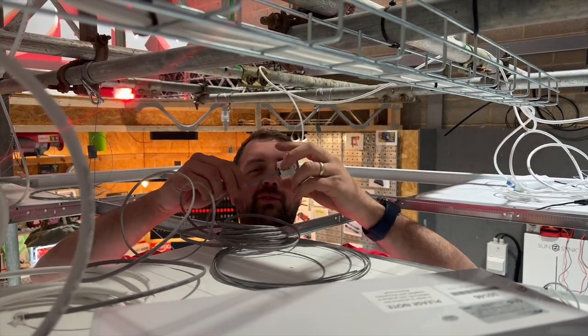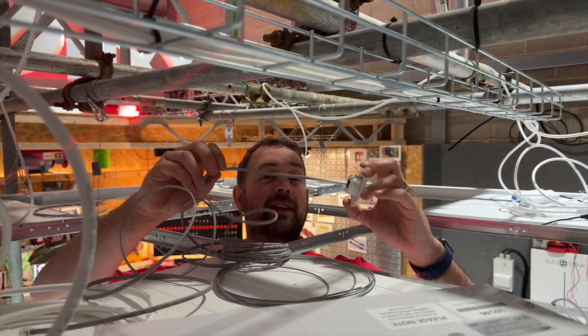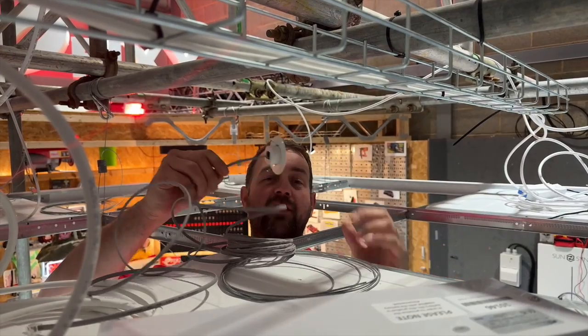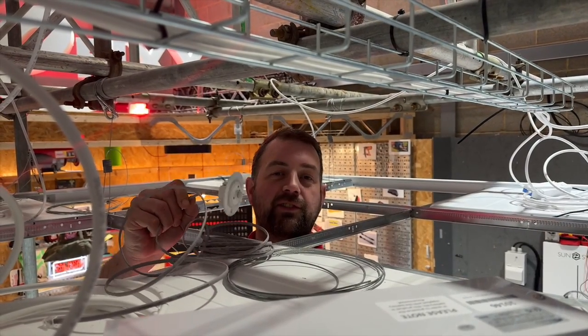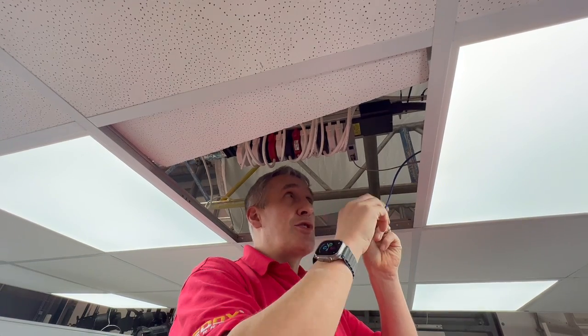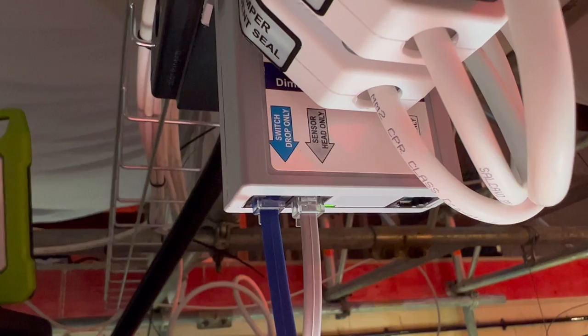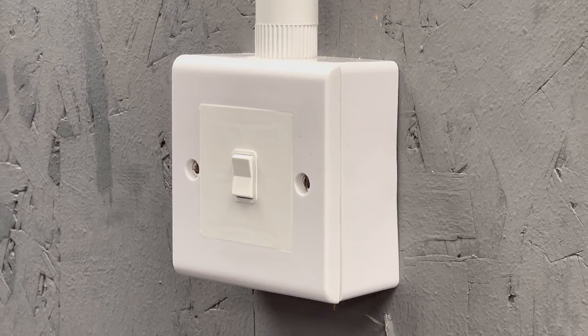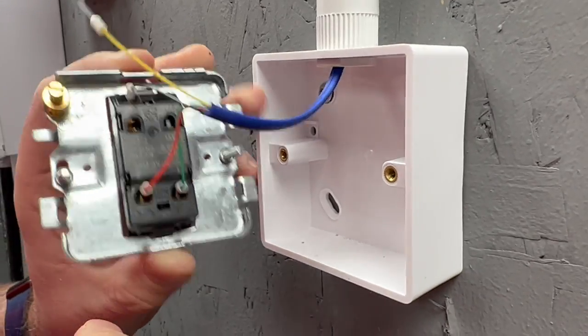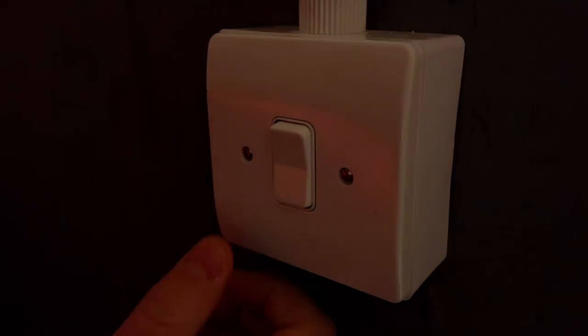A suspended ceiling can hide a multitude of sins, and just because we're installing safety extra low voltage cabling doesn't mean we can ignore the regulations — not like those pesky data installers do. Now, if we'd opted for absence-based detection in our new space, we may need to add an extra switch. And remember, the switch at the plate isn't switching any real current — it's just sending a signal to trigger the relay inside the lighting control module. In our system we've utilised the pre-wired switches from Flex7, but you can use any manufacturer's retractive switch if you want to match other wiring accessories in the area.